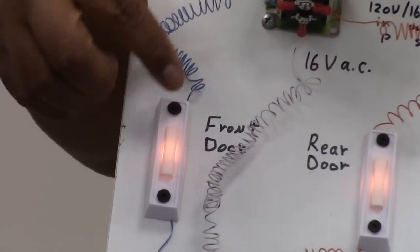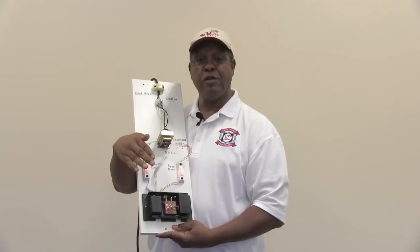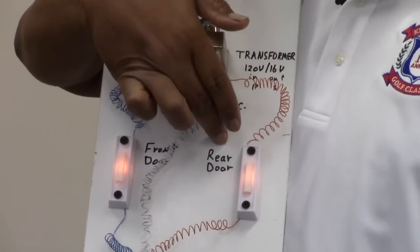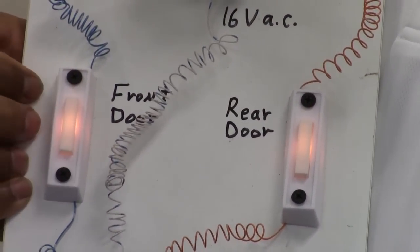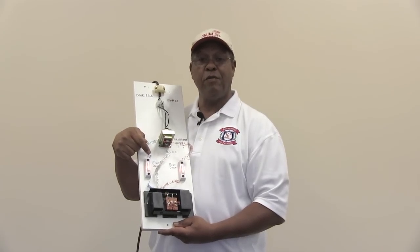It travels down from here to the doorbell at the front. You can see this doorbell that says front door, and when I press this button for the front doorbell there will be two chimes — which I'm not going to do at this point because I want to go through the entire circuit before pressing the buttons. Over here on this side it has a rear doorbell button, which is also lit up. Both are lit up to indicate that they are energized, meaning they have power running through them. The power coming to the push buttons is 16 volts, so it's very low voltage.